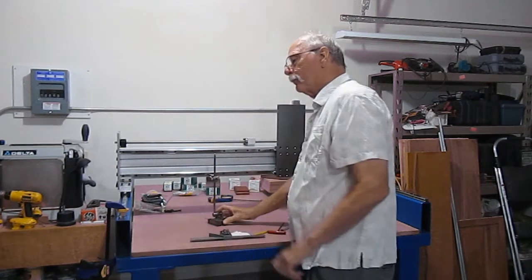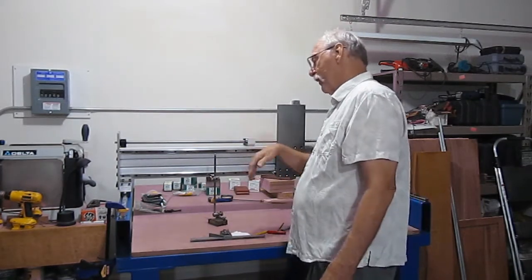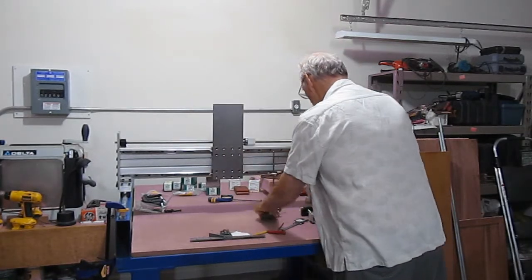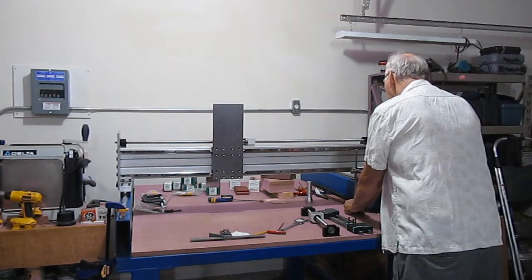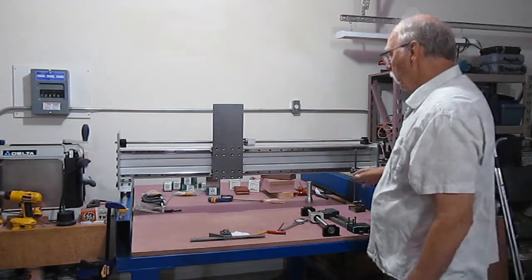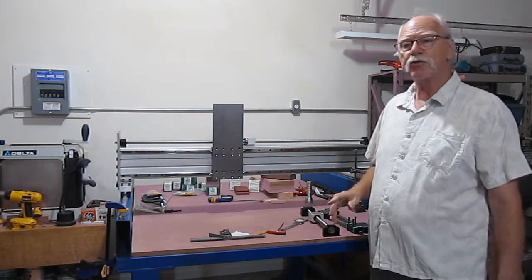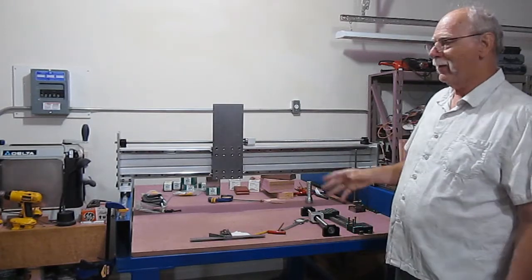Zero. Now again, you're going to have to trust me a little bit on this one. I'm not going to move the camera and show you. I could. And come all the way to this end over here, plus 5 thousandths. Across 52 inches, I have 5 thousandths run. Do the math. That is all.